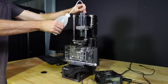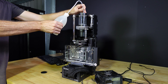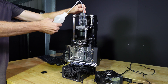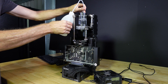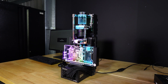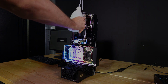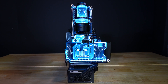The customer wanted heated stainless tube. I've actually heated stainless steel tube with a blowtorch to around 500 or 600 degrees, and if you heat it different amounts in different places, you can get a lot of different colors. You can see the tube goes from golds to blues to purples. This was one of the customer requests. I found this tube to be extremely unforgiving to work with — it's incredibly hard to cut and really hard to chamfer. Stainless steel is a very hard material, so I used big power tools for cutting and chamfering. It also slices the o-rings if you go in on a slight angle, so you have to be really careful.